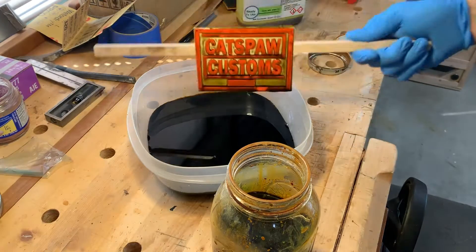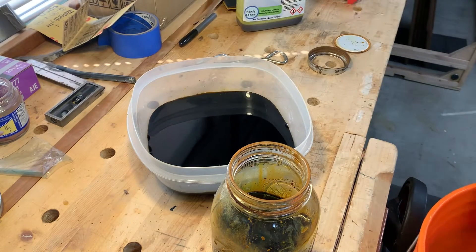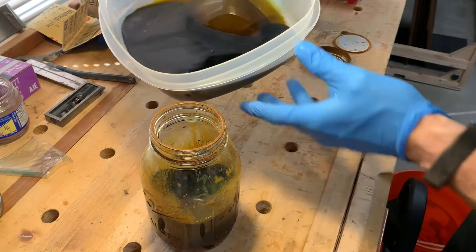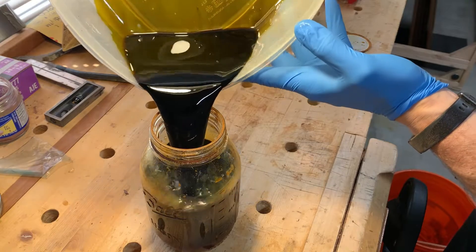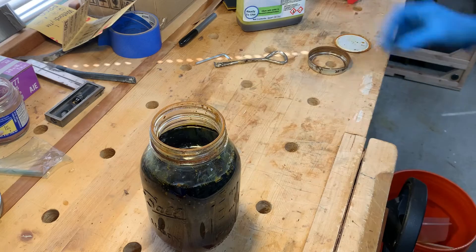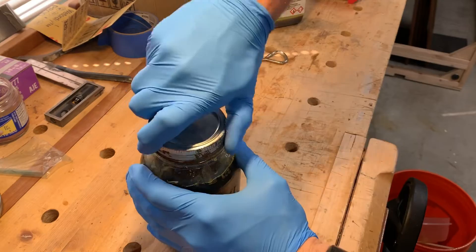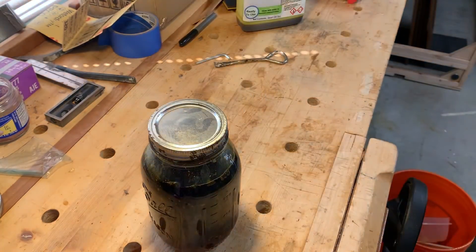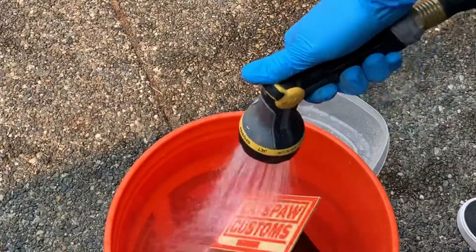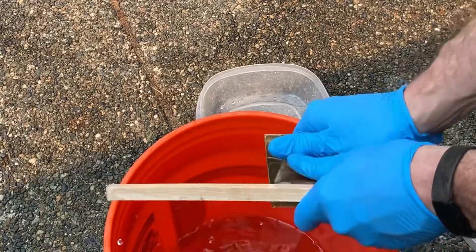After two hours I remove my plate from the acid bath and as you can see it's pretty well etched. I go ahead and throw this into a bucket for rinsing. The ferric chloride can still be used for future etching although the more it's used the less potent it's going to be. You can store it in glass or plastic but definitely not metal — as you can see from the lid on this mason jar it is pretty well corroded. I then very thoroughly rinse all the stuff the acid touched with clean fresh water. You can also use baking soda to help neutralize any remaining acid on the brass.